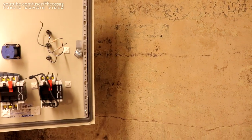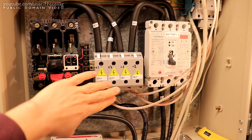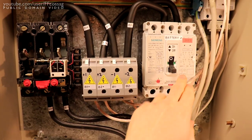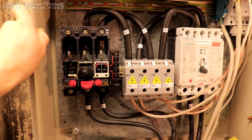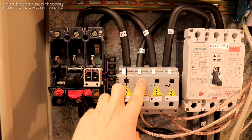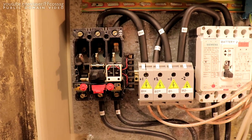So you don't slam the door into it - just wire it up with four wires going over there. That way we just have redundant everything. We can even remove everything on one side without affecting the other side. It enables us to easily, if we have an issue with one breaker, keep the other breaker on and do work on that side. We can disconnect these terminal blocks to completely isolate everything - giving us a clean, sterile workspace.